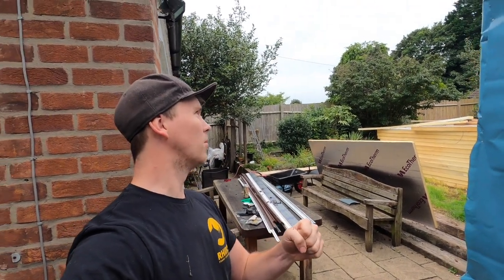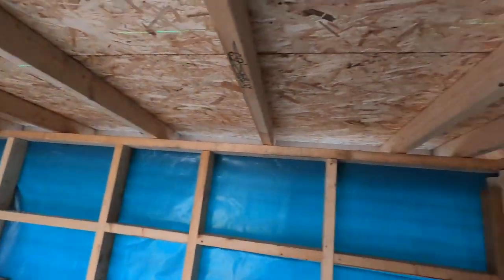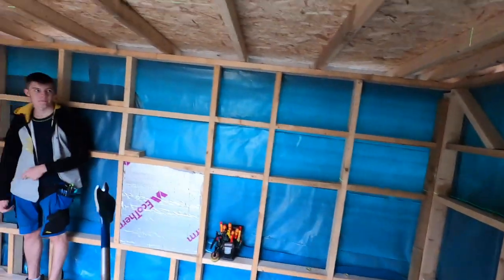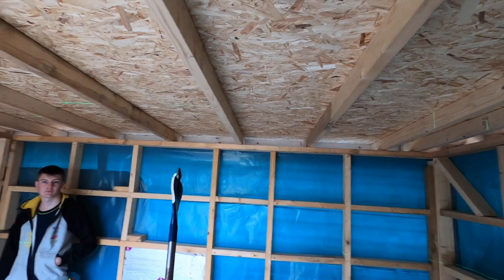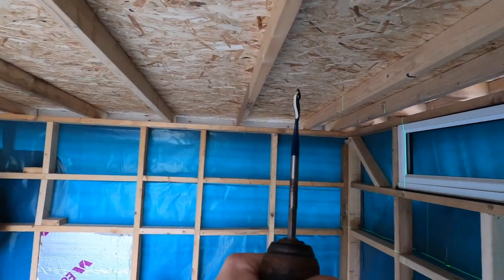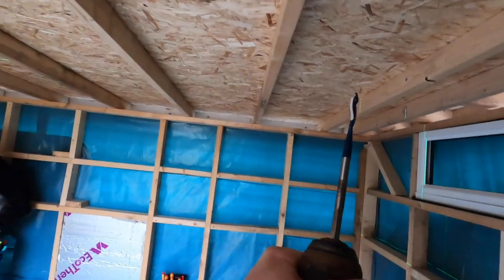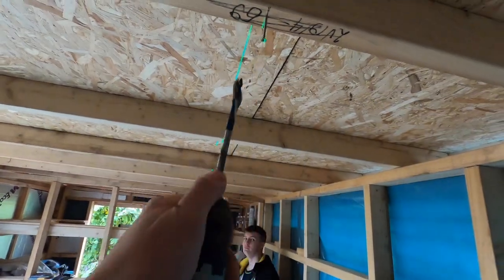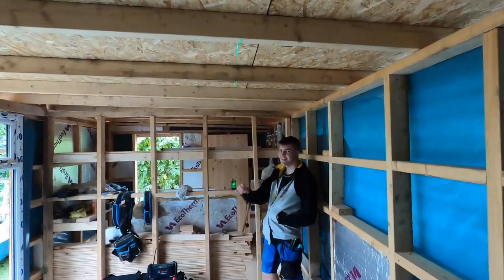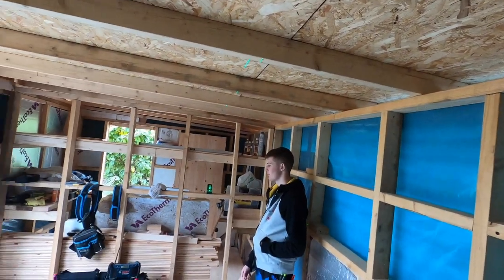We've got most of the stuff out. We spoke to the customers and we're going to start mapping out where the downlights and sockets are going. We've measured out where we want the spotlight — measured the full length of the room, halved it to get the centre. If you do exact measurements, you end up having the spots more in the room. But there's a desk going here, so we've pushed them back a bit — 130mm from there to there. We've measured off the back 700mm, so 700 to here, 700 to there. Adam's got the laser out to get the lines cut as neatly as possible. We're also going to measure the centre of the joist and cut exactly through that.